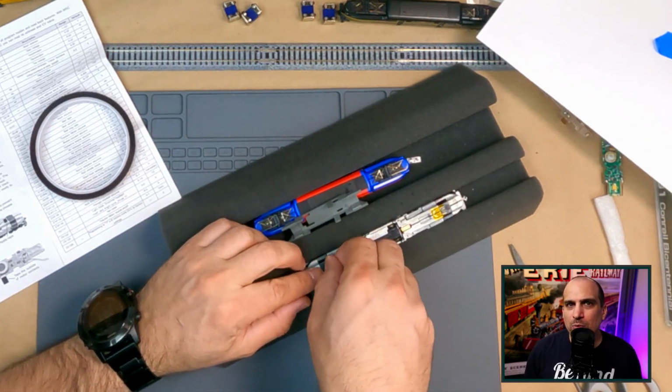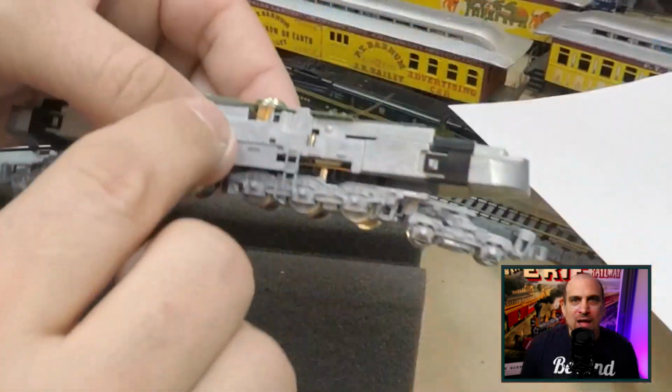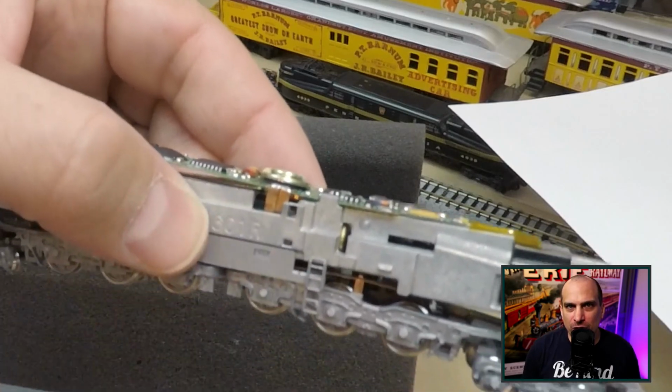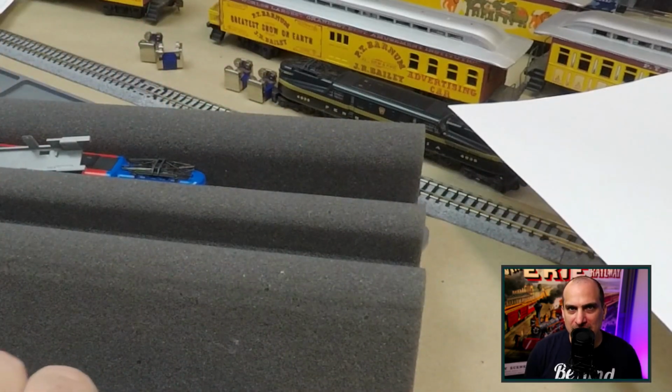These pieces of tape will be just below where the LED lights are located on the decoder. I also put Kapton tape on the outside of the motor contacts on the decoder. It is very important that the motor contacts are not touching the chassis.